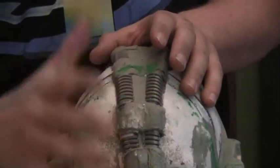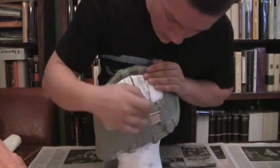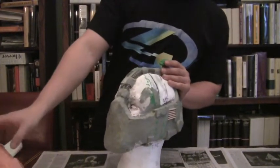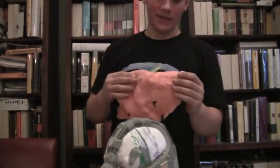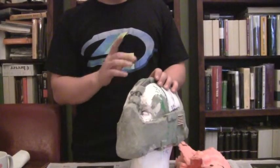Make sure your sculpture is done — any final touch-ups, do it. I drew a line all the way across. Everything past that line I had the clay behind it, and then I brushed on the Rebound 25. It comes in two parts: Part A and Part B — mix equally. For the first layer, take a fine brush and get into every single crevice. Very thin first layer.